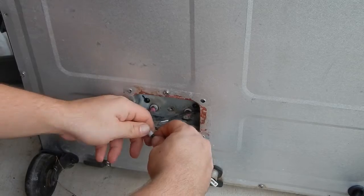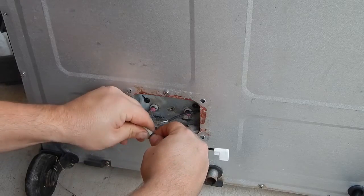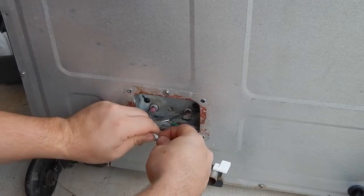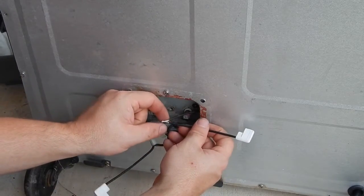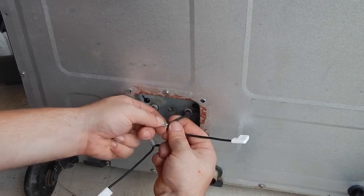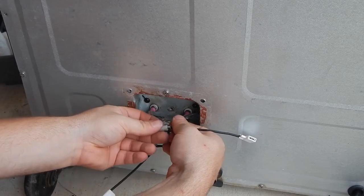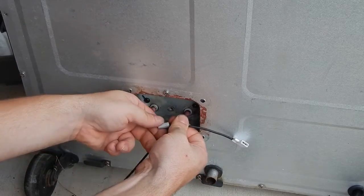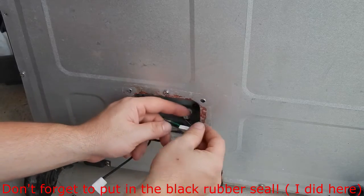Spin the cap on — that's how you use a wire nut, pretty simple. If you stripped it too far back and you can see metal past the wire nut, you need to cut part of it off. You don't want metal exposed past the wire nut; the wire nut acts as an insulator so you don't ground it out. This really isn't the best way to do this — the best thing would be to solder the wires and heat-shrink them for a nice weather-tight seal, but for testing purposes we'll use the wire nuts from the Masterbuilt kit.